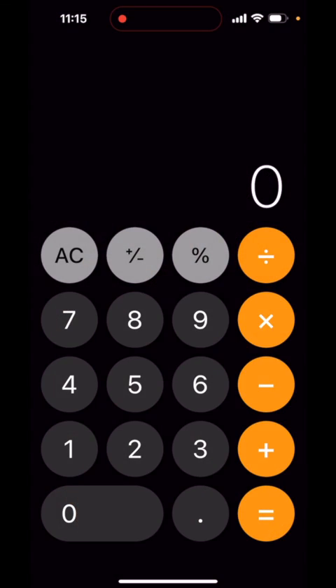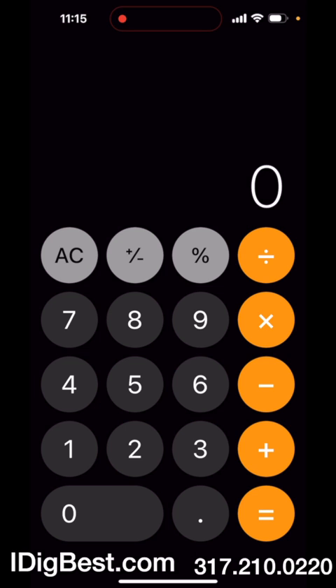Let's use a calculator on my phone to figure slope — let me show you a couple of ways, it's really simple. You've got to go tenths instead of inches. So let's say you take your laser, walk 100 feet, and shoot two tenths of difference — what is the slope? Two tenths divided by 100 feet, times 100, equals two percent slope.